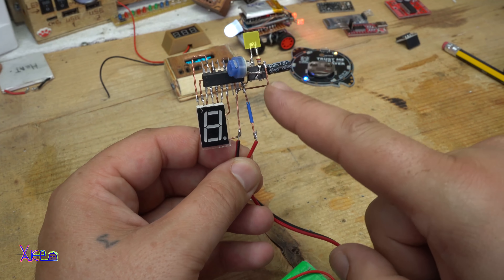The unfinished project is this wooden wrist watch. Yes, it will be a wrist watch, but it's unfinished. It has a charging port for charging the lithium battery inside, and these two small buttons are for setting the time. Here I have put six pins for programming the Arduino chip. It has a push switch for the light, and also an on/off switch so you can turn the LEDs on or off.